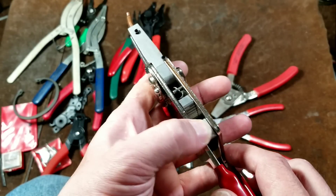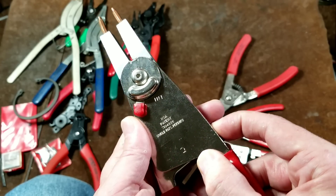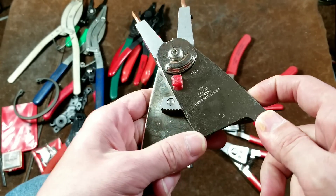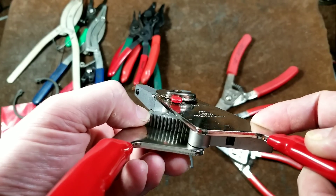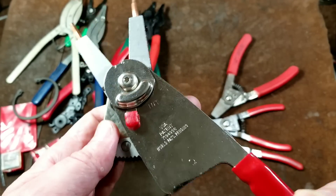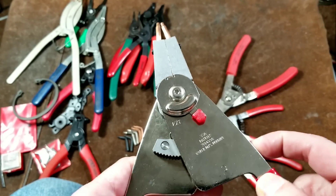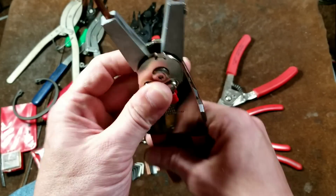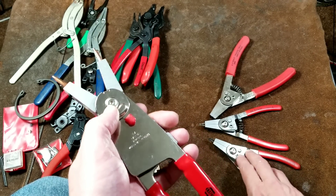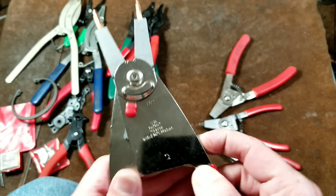These work via a ratchet mechanism. It's not the easiest to grasp at first, but once you get used to it, it's not so bad. They don't want to make it too easy to accidentally bump when you have a lot of tension on a snap ring. It is a super heavy-duty ratchet mechanism — you can see how thick it is, about 5/16ths of an inch. The ratchet pawl is a big solid piece of steel with 3 or 4 teeth, so it's way overbuilt. To reverse, in any position you just flip the switch, open it and jiggle it a little bit. Looking at the top, you can see these bumps are not parallel — there's a little plate essentially pushing on spring-loaded versions of these pins.